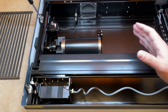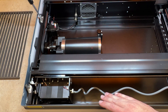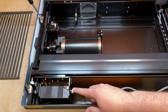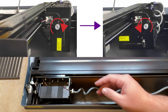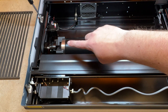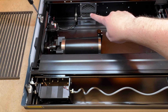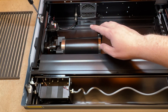Real quick look at setting up the rotary tool to save you guys some time. You will have to pull the arm all the way forward to the front of the unit. You'll also have to flip your laser head — I recommend doing that before pulling it forward, it's just easier. You unscrew both screws on each side — this little silver screw here and here — then flip the unit and re-screw them back into the corresponding holes. Then install the rotary: there are two screws you pull out of the machine, put your rotary in, and send the cord to the back of the unit. Make sure that cord is plugged in before you turn on your machine, or the laser head will home back up front.